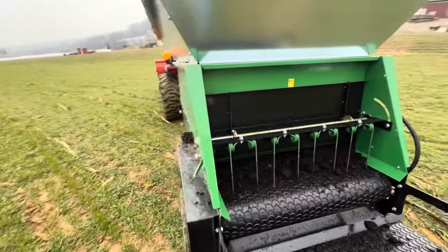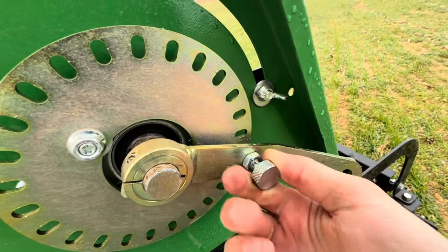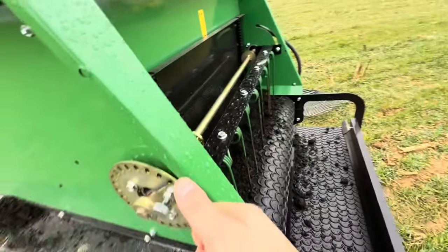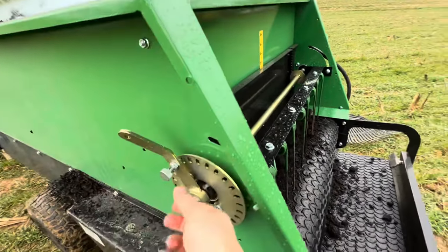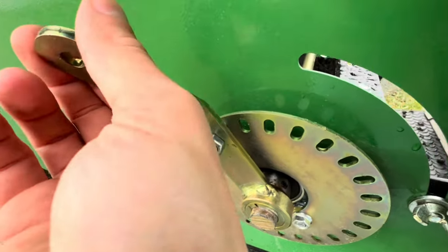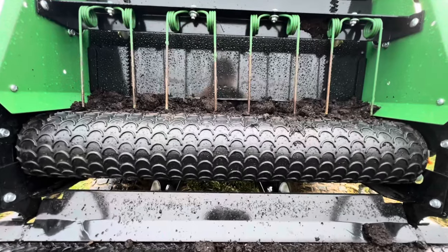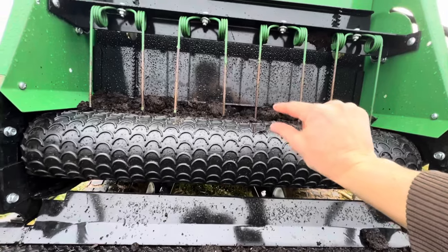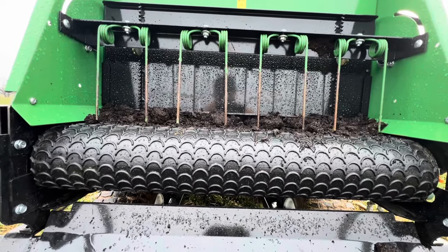You've also got the end gate over here. You've got a little spring pin that you're going to pull out. Lock it into place, and then you can see exactly how this works — extremely simple system. I'm going to close this down a little bit, and then rotate this spring pin to lock back into position. That'll keep the gate fixed. That's going to control how much flow you're actually getting out the back of the spreader. You can open it all the way up or close it all the way down, depending on what you're looking for out of your spread.